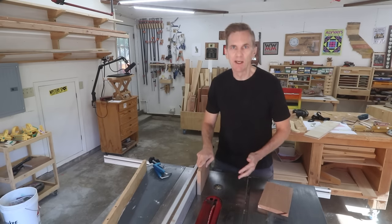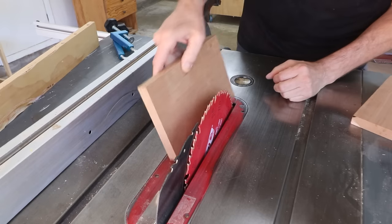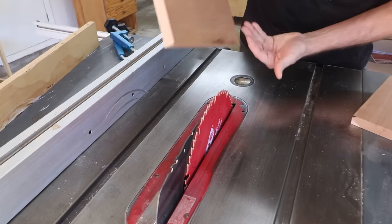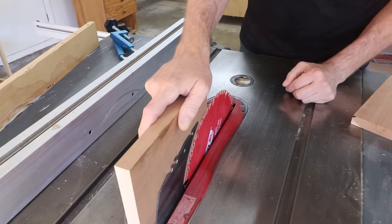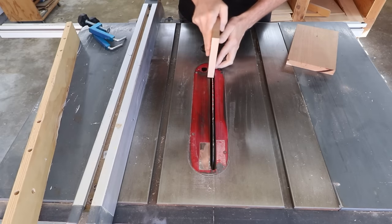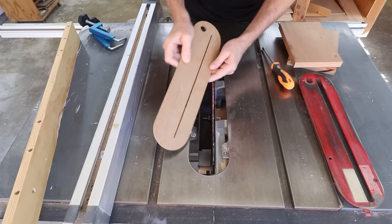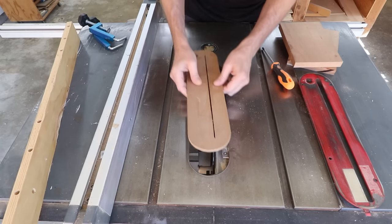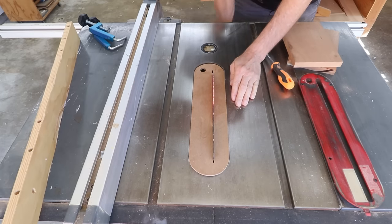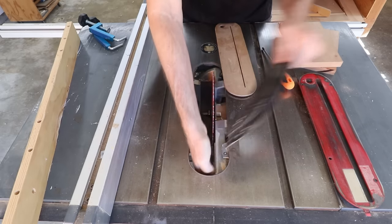You need to keep the board from tipping and keep your fingers well away from the blade. With my blade raised as high as it'll go it's still not even close to being able to cut through this entire board. But it's more than half way, so I should be able to cut halfway through and then flip it around and cut through the other way. The first thing I need to do is remove this throat plate because this gap is just too wide and the board can fall into it. This is my zero clearance insert plate — it's got a slot that's the same thickness as the blade. The only problem is that I won't be able to raise this blade all the way up and keep my riving knife in place, so I'm going to need to remove that for this cut.